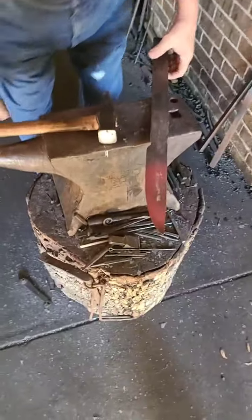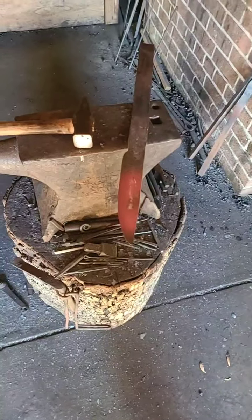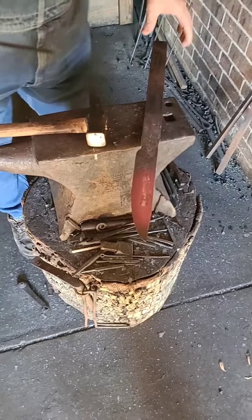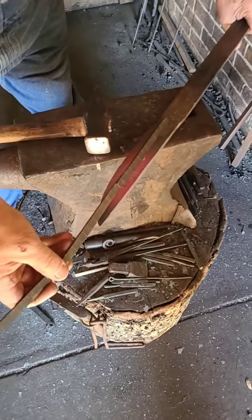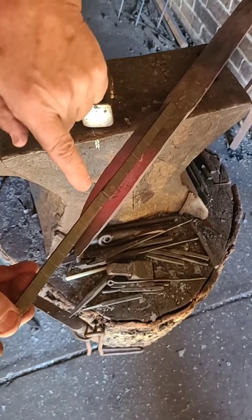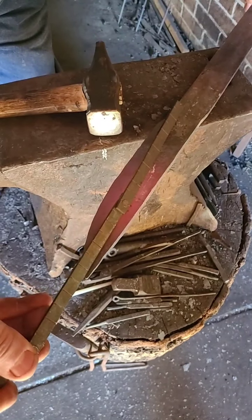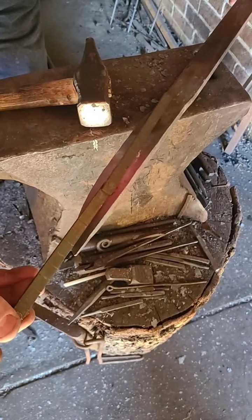In the act of straightening that out, I'm actually going to bring the clip down and the tip down just a little bit. Let's check the length of it - looking for my measuring device. In the blacksmith shop, early days, we used a folding rule and of course it had to be made of steel because there wasn't much else to make them out of - a modern day tape measure might also melt. That rivet on the measuring device is at six inches, so it's seven, eight, nine. We want to be a little over nine for the actual blade, but there's also profiling and bevel grinding to think about.